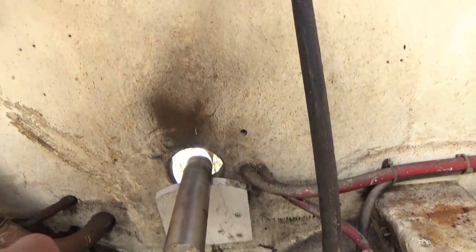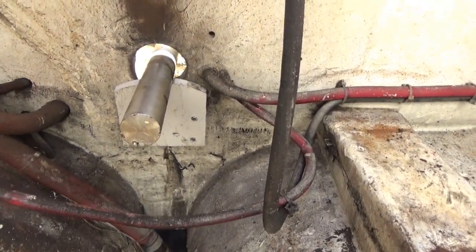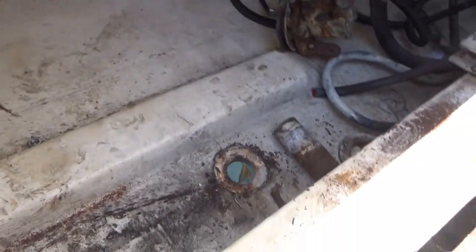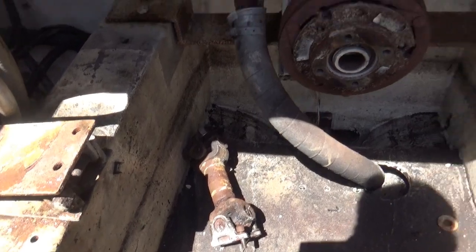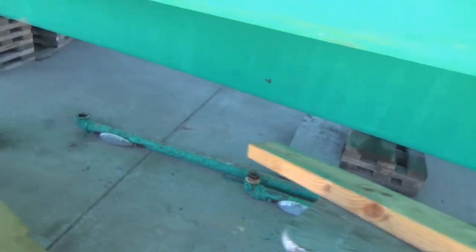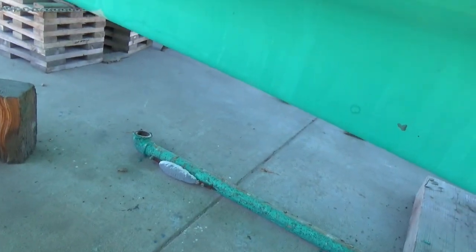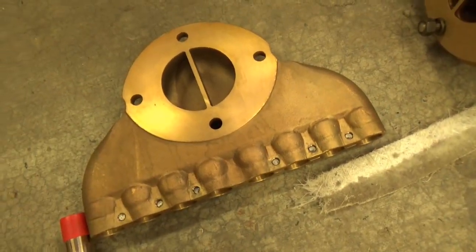He put a piece of starboard right here to hold the shaft kind of in place to figure out where to put the gear and get the engine out. Here's the hydraulic pump that comes off this little drive shaft off the crankshaft. Here's the old keel cooler — just a two and a half inch pipe. There's the through hole, pretty straightforward, just a big loop. We're gonna be using a pre-engineered keel cooler, not just a piece of pipe.